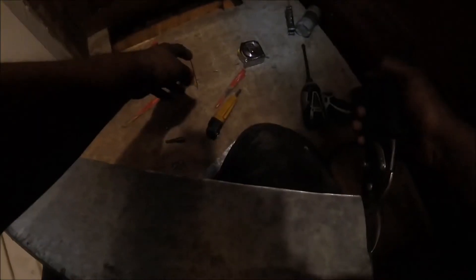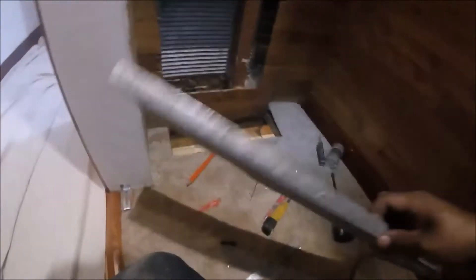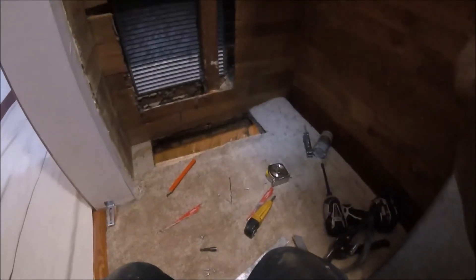Right here is where I took off the old sheet metal — I'm showing you how it was positioned before. It was just too small; the opening was like 14 by 4 or something like that, way too small. So I'm going to use part of that to cover the hole, then make a larger hole and box it in. You can see it's already been sealed from the bottom with duct sealer.